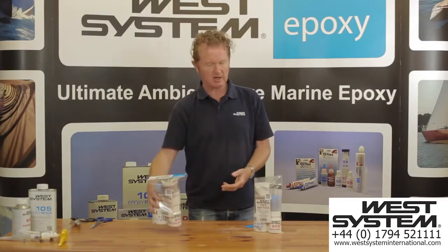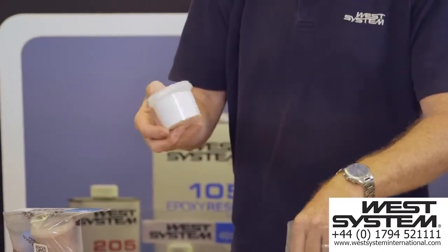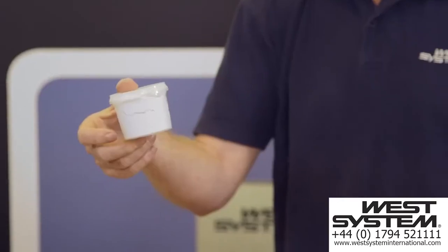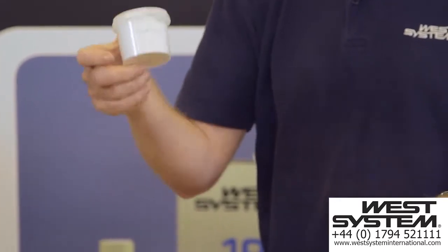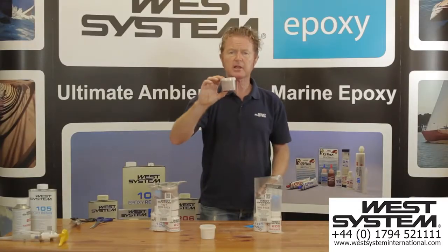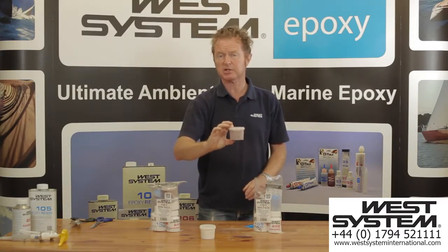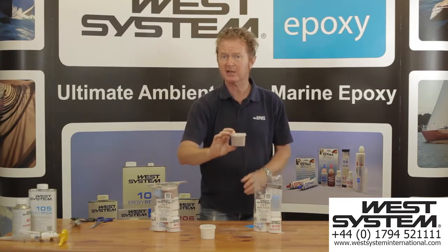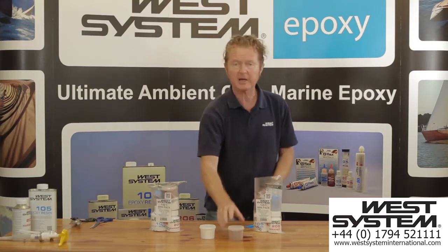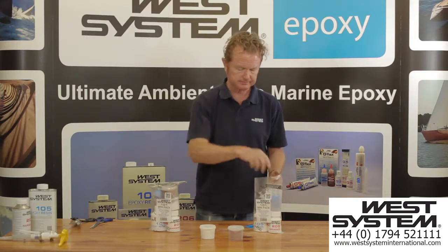The contents are fantastic. Within the pack you have two fillers. You have the 403 microfibres, perfect for making wood joints, a very high density filler, immensely strong when mixed with West System epoxy. And you also have the low density filler. This is perfect for making a rough surface nice and smooth, in other words filling it prior to sanding it fair. It's also incredibly good for making lightweight fillets in a small sailing dinghy or small motorboat.